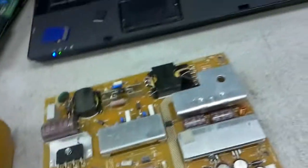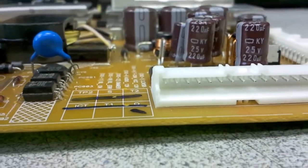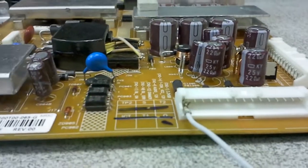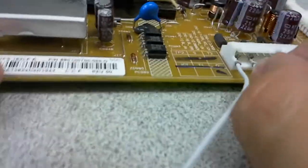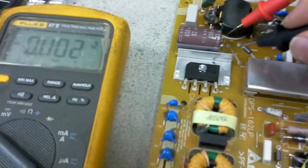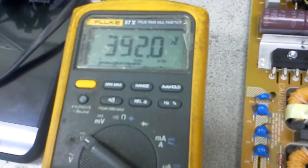The next step is I will take a simple cable out of a multi-wire cable like this, and connect it from the 3.3 volts to the third pin, which is power on. Now the board makes a very faint noise — ticking, literally. What happens is, as I said, the power factor correction circuit gets engaged. So there will be 400 volts here — 390, 400, somewhere there — 392, and stable.